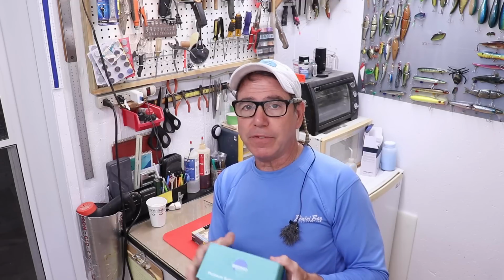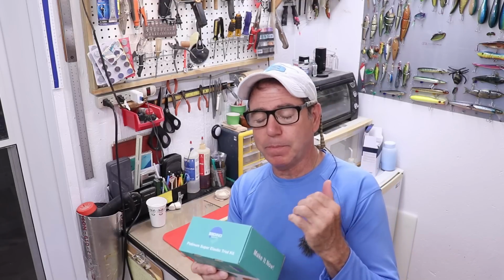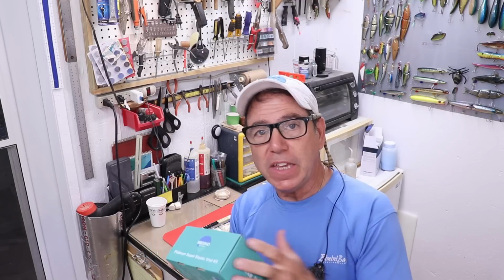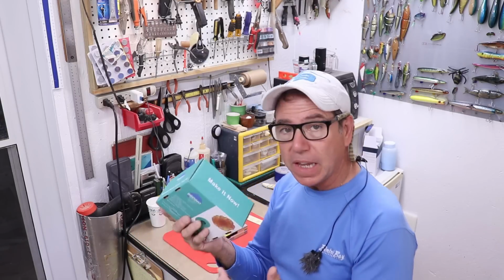And the only drawback for me, at least, is that it's platinum cure, and I don't really like the platinum cure that much. The common wisdom is that the platinum cure is better because it lasts longer as a mold on the shelf, but I haven't found a big difference. And the ease of use of the tin cure just overrides any extra length of life on these things.